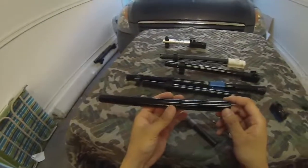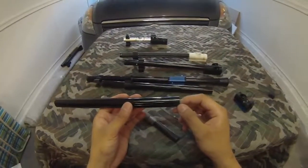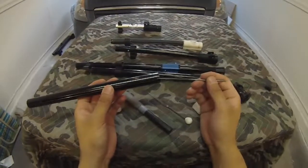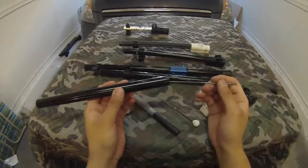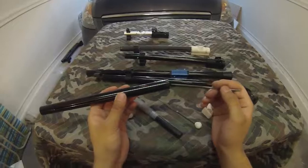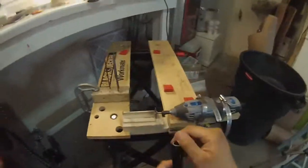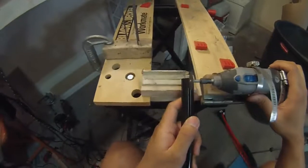So it's kind of just an extra measure to secure the tube into the mount. But if you are upgrading from a Gen 2, one of my early Gen 2s, or a Gen 1 to the Gen 3 and beyond, you also need to remove this tiny bit of metal here. What I usually do for this is I zip it with a Dremel and then just file down the top and bottom so it's kind of even with this. It doesn't have to be very precise. This is going to also be in the mount, obviously, so you definitely don't have to make it clean. I usually don't bother getting it perfectly level or perfectly smooth, so I'm just going to do that real quick. All right, I'm going to extend the slot all the way to the end of the tube.